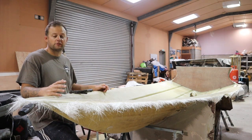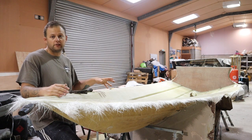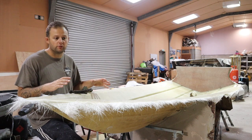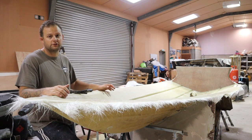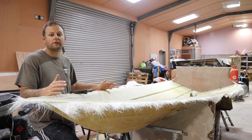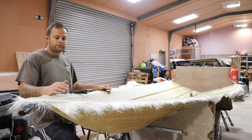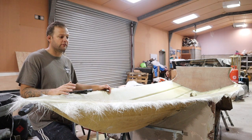And it's a cradle, so it's a mould that's been trimmed down, that's thinner. So at least when this skin goes back in, because like we say, when things like this come out, they can twist and turn, it'll reset itself back in that mould in the shape that is expected of it. And that way we can install the deck, install the tube carriers, trim up everything, and then it'll be ready to just be lifted out by a couple of guys onto the trailer once it's ready to go.